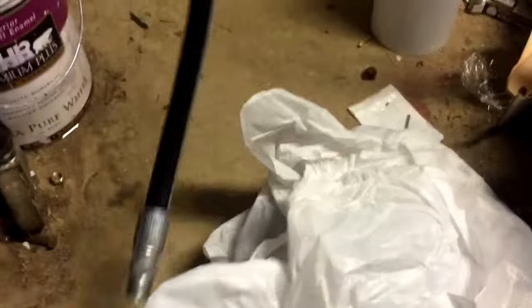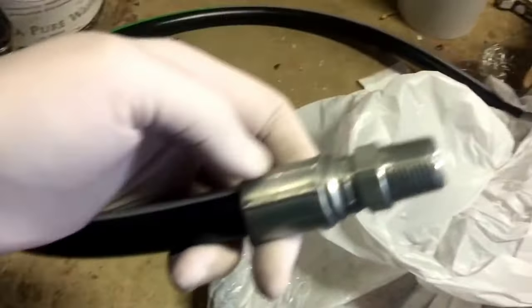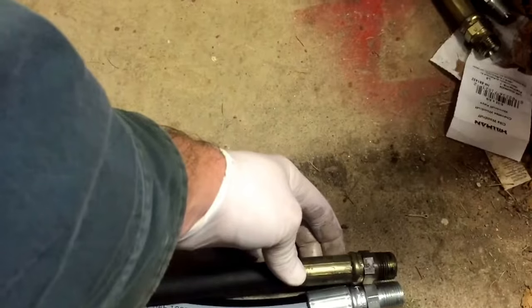I got some new hydraulic lines for the Deutz-Allis. I went down to my local auto parts store and they made one — it cost me about 50 bucks to have a three-foot line made, so it sucks, but here's the new line. It's made out of Gates half-inch hose and they crimped on new ends. This new hose looks like a garden hose, while the old hose has kind of a wrapped design. I just trusted that it was correct and it looks pretty spot-on. I'm going to go outside and see if we can put this on there.